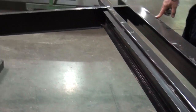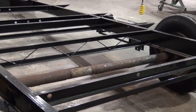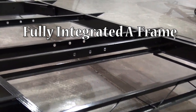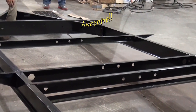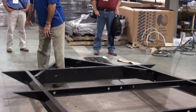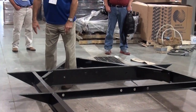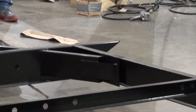Even the A-frame hasn't changed all the way up from the Eagle trailer down to the J-flight. What I've got here is an A-frame that's fully welded. Almost all competitive units tack-weld the A-frame to the bottom — so there are only 2 weld points at the bottom of the frame, where you have tremendous torque and twist in the hitch area. Here we integrate it right into the frame, weld it, put additional gussets, and weld those to the perimeter frame. There's no stronger frame application, even in our J-flight units. It's the proper foundation.